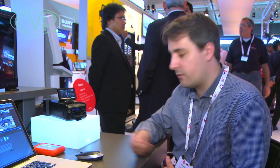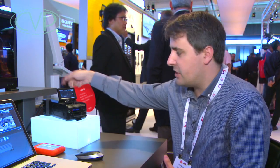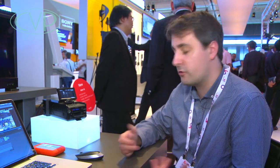It can also be used for playback, so if you've got a PMW-500 camera or the new 200 for example, and you've been shooting a package that you then want to play up via the satellite for your truck, well then this is the product you need. So you take your cards, put them in here, HDSDI out, cue it, press play, and it'll play. It's very portable, it's battery powered, so it takes the BPU batteries.